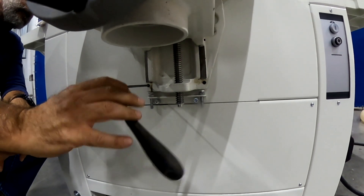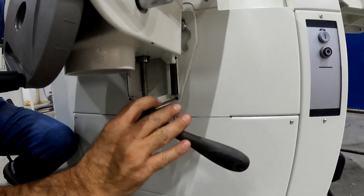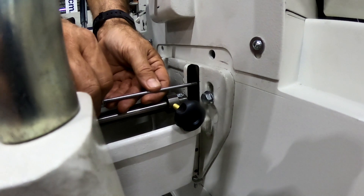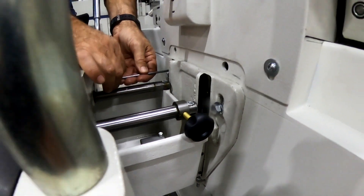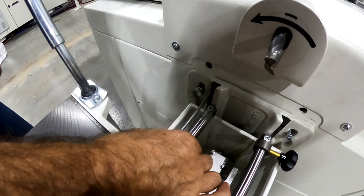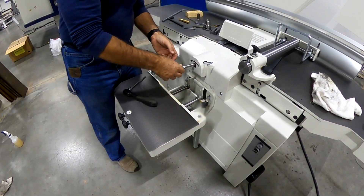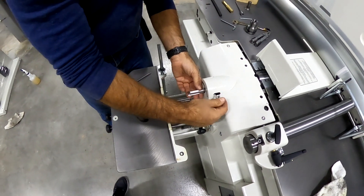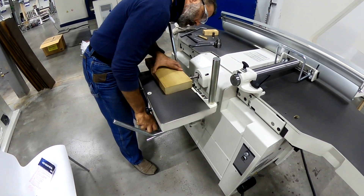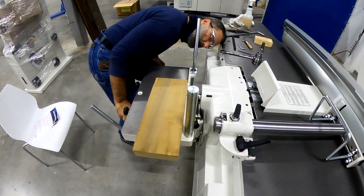Here are your plumb adjustments for orienting the table so that it is level and parallel with the cutter. There are four points — two at the bottom, two at the top — to get your orientation just right. Now we will mount the tool and take it for a spin. Here you can see me setting the height and the depth of the table for the first test cut.